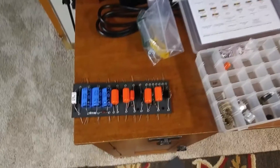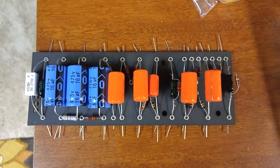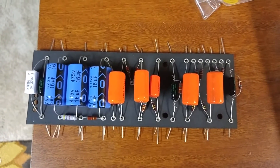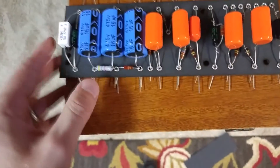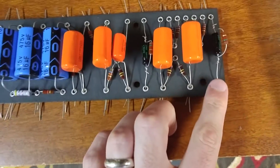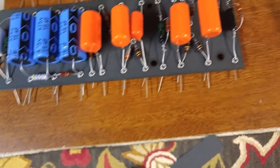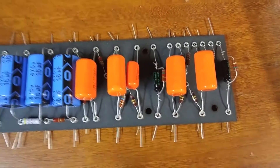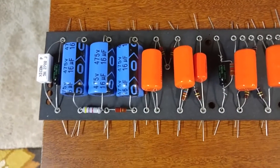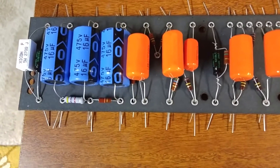Another update on my 5E3 build. You can see I've got some components assembled onto my circuit board — just a couple of quick thoughts and tips. These eyelet boards are pretty easy to work with, but just be a little bit careful when you're bending component leads. Try to measure out the lengths once and then get the component leads in there just right. One thing I also like to do is put everything in first before soldering. It gives you a chance to review it, and if you make any mistakes — which you possibly will if it's your first time — it's a nice fail-safe so you don't have to un-solder anything.